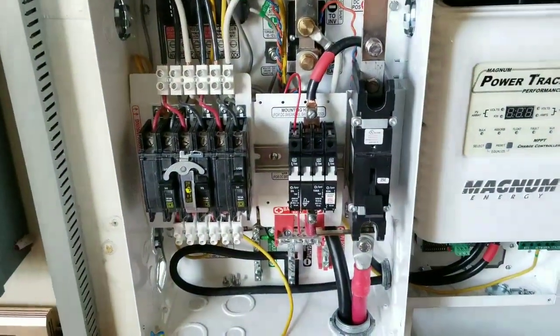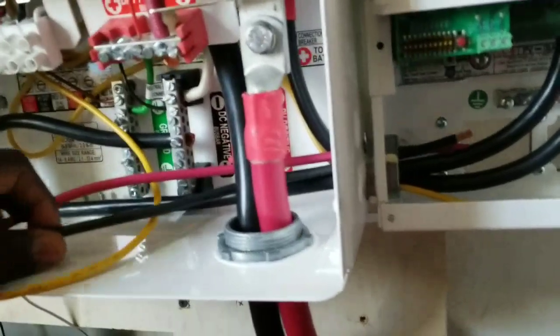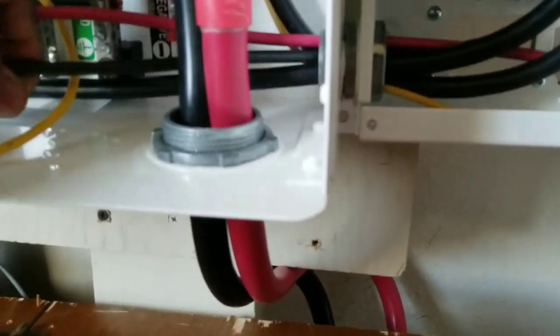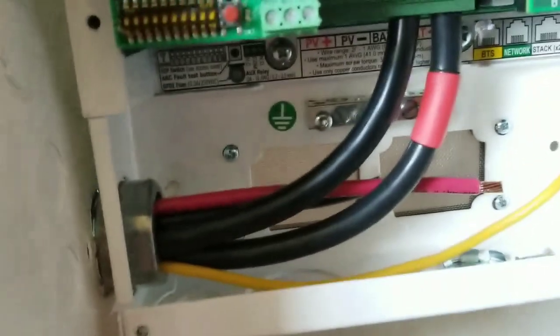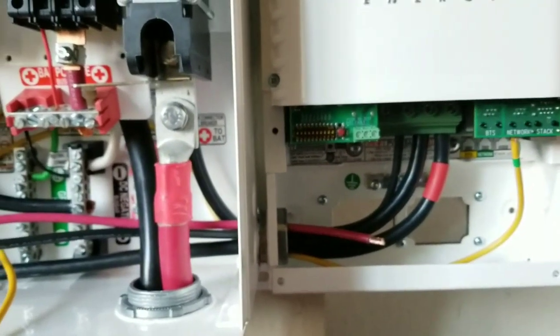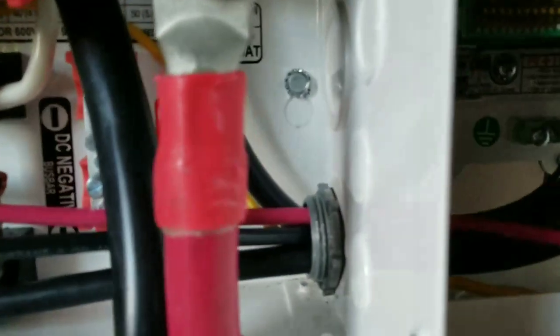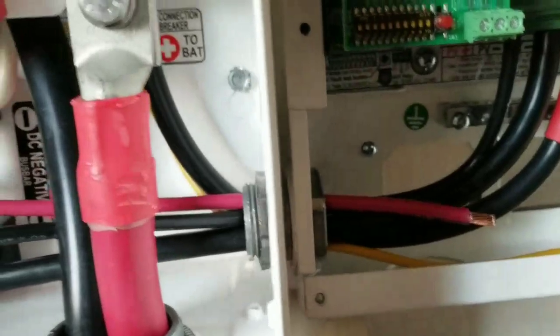We're going to go about installing the PV and we'll get from there — stay tuned, like and subscribe. As I'm bringing in the wires, you can see where they come in and I'm trying to arrange and align them where they're supposed to go. The first wire is already in — it's black — and I'm running out of space on that conduit. But since it's THWN or THHN, they're kind of slippery and they just glide in and get the job done.